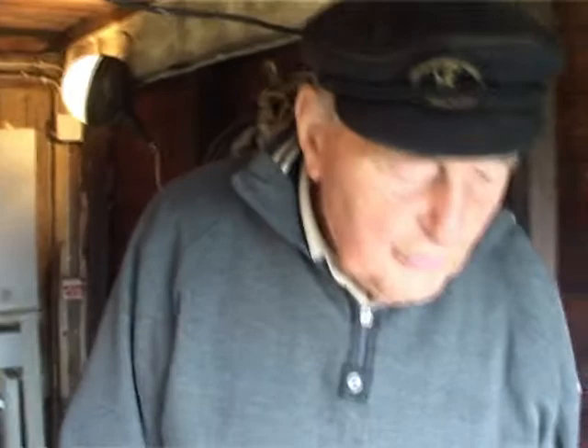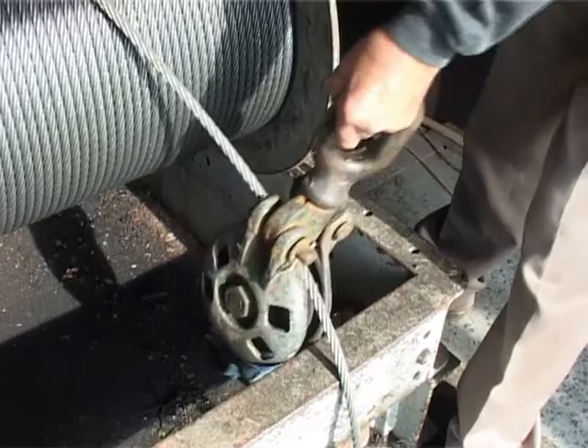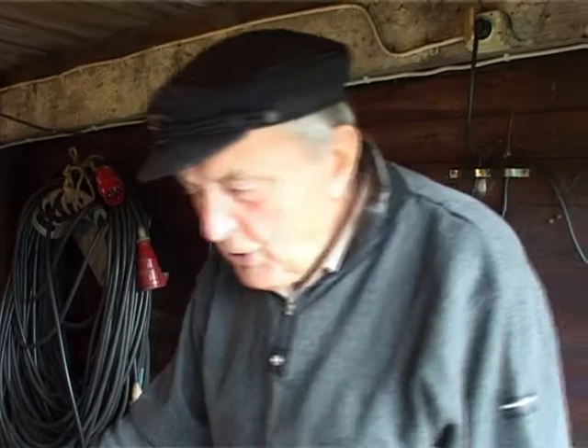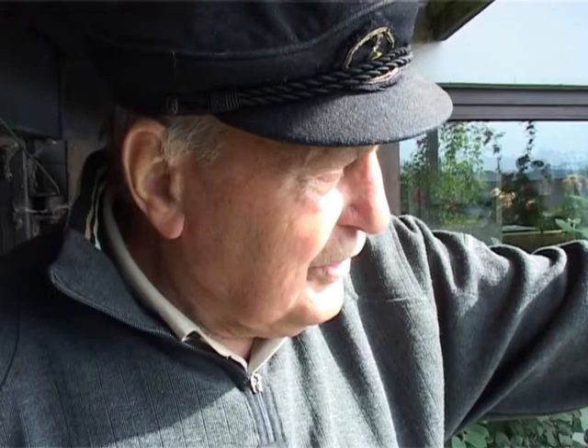Very important also is that the wire guide (Seil-Führung) is outside the winch — the block pulley (Klapp-Läufer). The block pulley, the slow one, takes half the load, and the pulling force is doubled. That means with the help of the block pulley I can achieve 3 tonnes of pull, whereas otherwise only 1.5 tonnes is the maximum.